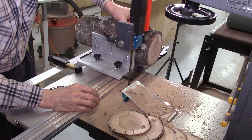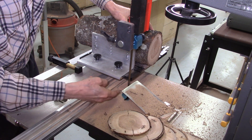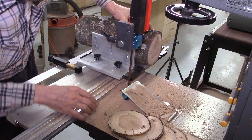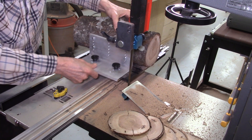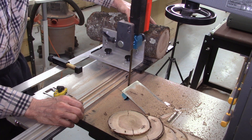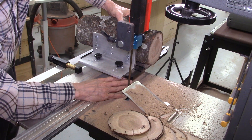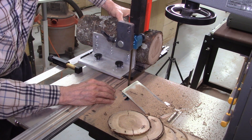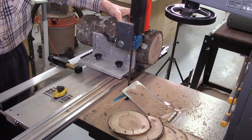I'm going to have to make a dust shield for this AccuSled because this dust clogs up those bearings on the AccuSled pretty quickly, and that's why you start seeing that jerky motion — it's getting full of sawdust in there. I've got to get a better way to keep that cleaner. I'll be making some sort of thin aluminum angle iron to keep the dust out of there. Another project.